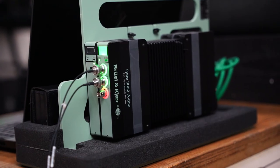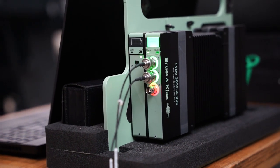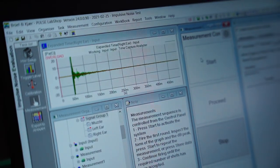We've since upgraded, and moving forward we'll be using the B&K 3052 Pulse Analyzer. What makes this so great is the sample rate is so much higher, meaning it can take more samples of data a lot faster, so it can find that highest spike — that peak dB rating — a lot easier than a device like the 2270. It also records a wider range of frequencies than any other device available to us right now. It is a really expensive instrument, costing tens of thousands of dollars, but we want to make sure that we have the best data to develop better products to protect your hearing.